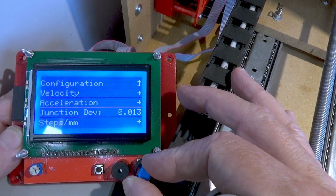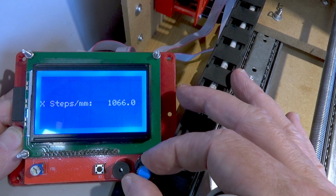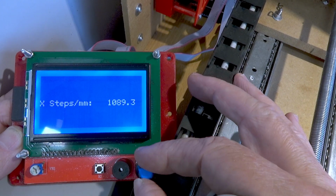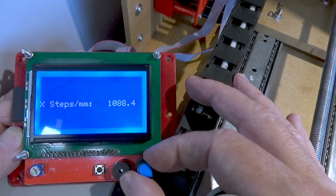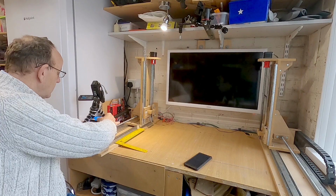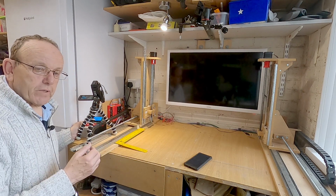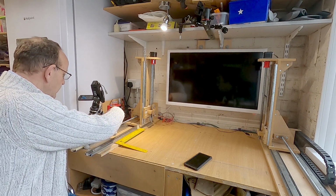So go to advanced settings, steps per millimetre, and then what we do is we go onto an axis there. So that said 1088. So it does take a while to do it. There we go. And then what we would do then, we would go and check it again, and make sure that was correct. So run the same test again and check it. And if you found that was correct,